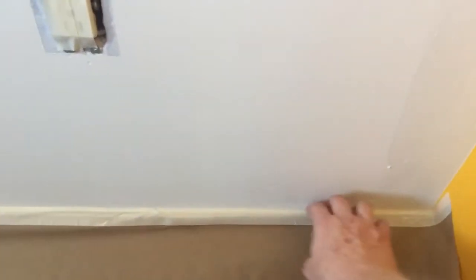When you're doing an accent wall or any wall that you wallpaper, you want to have protection on the surrounding walls and floor. At the very bottom you see this paper — this is eight-inch masking paper put on with a 3M handmasker. I've shown you that in other videos. The paper is on a spool and comes off pretty handily. You want to protect the woodwork because when you're pressing down on the paper, glue comes out, and it's unprofessional to be wiping off somebody's woodwork — better to catch it on paper that will absorb the glue.